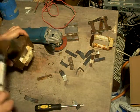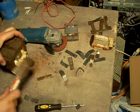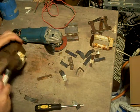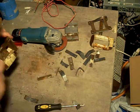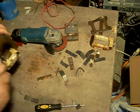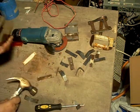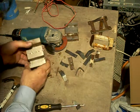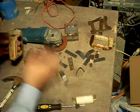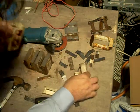It should eventually just drop off. There are pieces of glue that have come apart. I assure you they don't put it together like this in the factory — except for some cheap Chinese microwaves, so I suspect they do put them together like this. There is a rather heavy lump of laminated iron. The reason it's laminated is because it's alternating current — you don't want it short-circuiting. Remove the paper — it's actually mica. That is mica wrap with paper over-wind. That mica is quite handy — heat resistant.